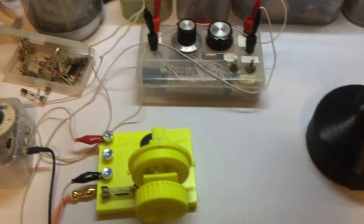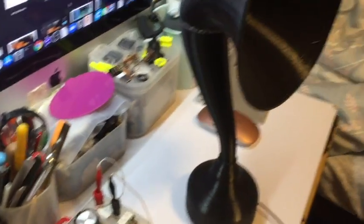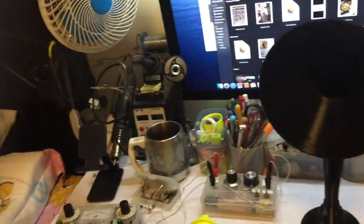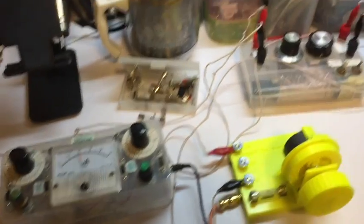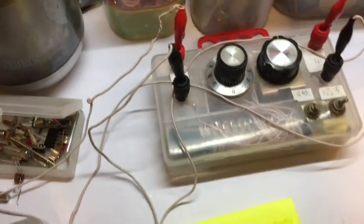I'm testing today without an amplifier, so the output of the crystal radio is connected directly through this step-down transformer to this gramophone speaker that I just created. There's a driver unit inside — it's the normal horn speaker driver unit, just a high treble speaker. We are able to hear it directly because I got a strong signal. The after-detection DC current goes above 300 micro ampere sometimes.